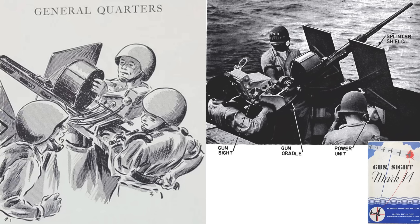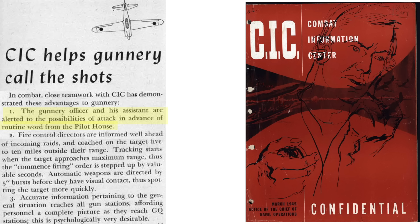The ship's general quarters alert is sounded when an air threat is approaching. We will assume some of the enemy planes have slipped past the ship's CAP. This information is relayed by the ship's pilot house, as described on this page from a March 1945 CIC document. All anti-aircraft batteries are informed of the incoming threat. The threat's position is relayed when they are 5 to 10 miles beyond the gun's range. Tracking and firing of the large caliber 5-inch proximity-fused guns starts at their maximum range. The 40mm and 20mm guns can point in the direction of the VT shells and time bursts in anticipation of the attack direction, saving time.